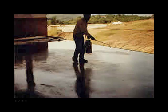Here's an illustration of someone spray-curing concrete. One of the quickest things you can do is spray a membrane over the concrete, almost immediately after it is placed, which is ideal. This is very commonly used. I'm a bit old-fashioned — I still like to see a visible membrane rolled out over the concrete with water applied constantly to keep it damp. So I'm not completely sold on spray curing alone; perhaps it could be one element of a series of steps to ensure moist curing.